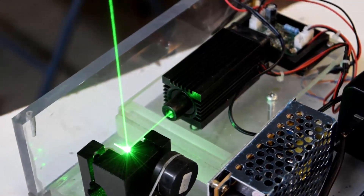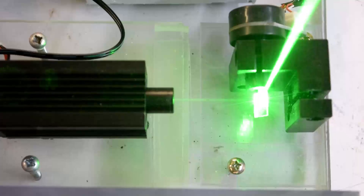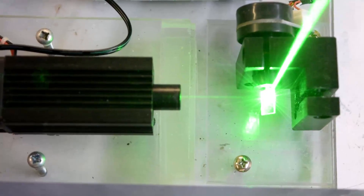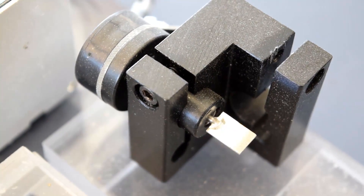Using a single laser, one may ask how do you make multiple beams out of one beam? Well, there's a trick to doing that. The laser is shone onto a face-silvered mirror that's vibrating extremely quickly, controlled by a high-speed galvanometer moving at 20,000 positions per second. We can also turn the laser on and off electronically thousands of times per second.